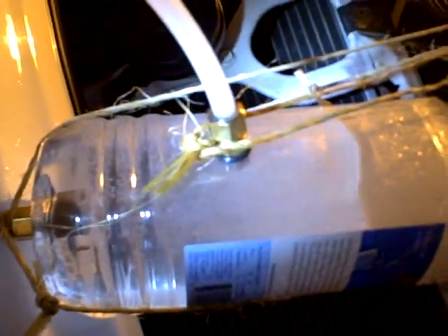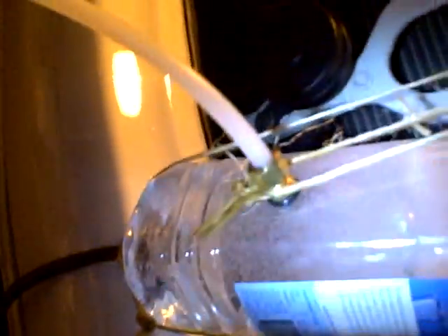Coming back over to the system here now. We do have some serious production going on here for one single cell — it's one unit with 10 cells. All my cells get to run at 1.2 to 1.48 volts for most efficiency versus power usage. You can see the bubbles just flying up through there. The system flows right out the bottom of the bubbler, comes into the bottom side of the unit, going through all 10 plates, and then coming out on the top side.